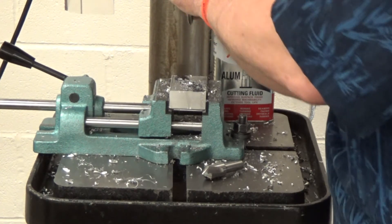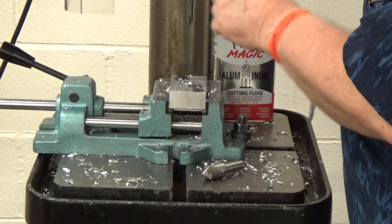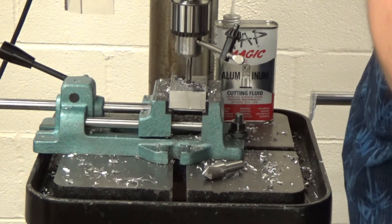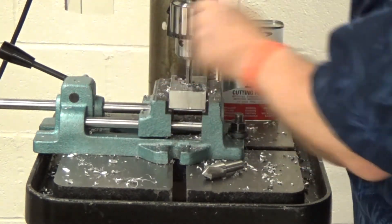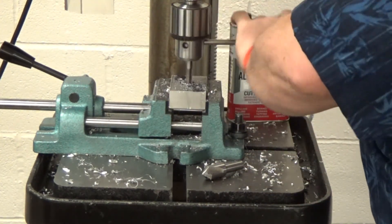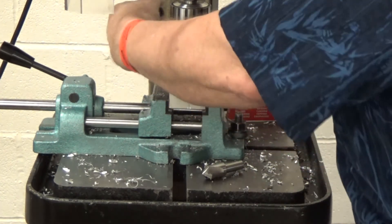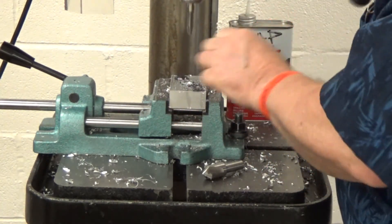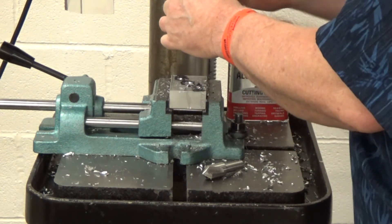I'm not going to do all the tapping here — I'm just going to get started. I've got the tap in there held tight. I'm not going to turn the machine on; instead, I'll put the chuck key in, tighten down the nut so the spindle doesn't move, and manually run the tap a few threads using the key. Getting three or four threads started here ensures that when we move to the workbench to tap by hand, the tap starts straight. That's just a little trick.